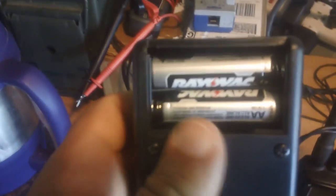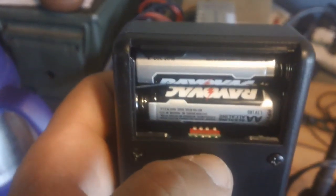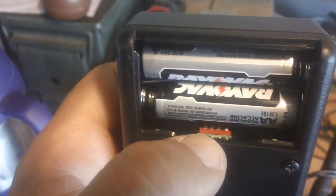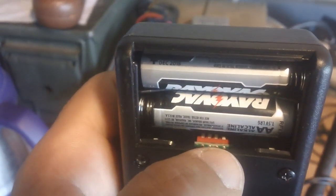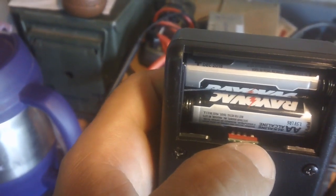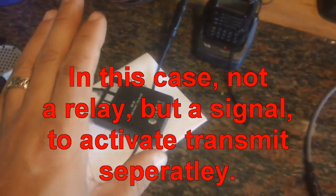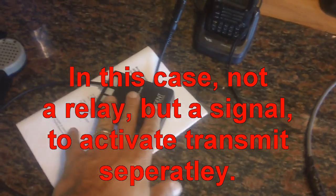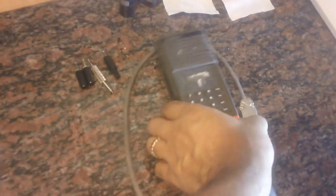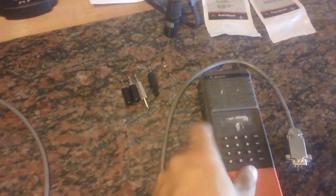As you look at the unit you'll see this little red block — that's a series of four switches: one, two, three, four. The farthest one to the right indicates whether to use a combined transmit audio and push-to-talk signal on one wire. If you turn it off, it disengages that and you use a relay to activate push-to-talk. That's an extra wire used to interface with a mobile, a repeater, a base station, or an older HT that needs a physical contact to key up.